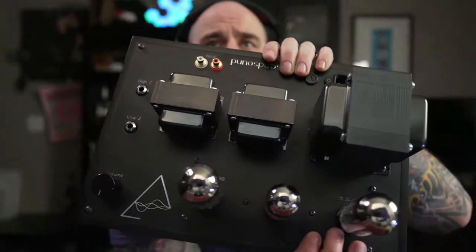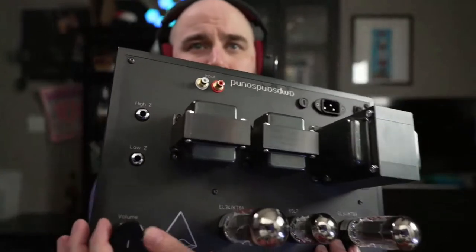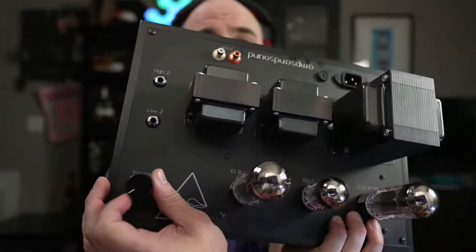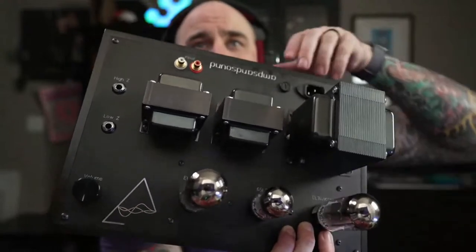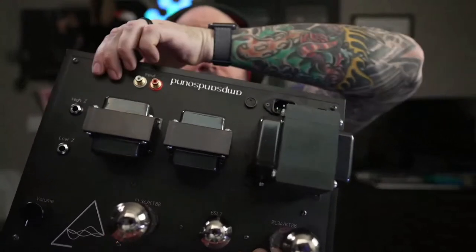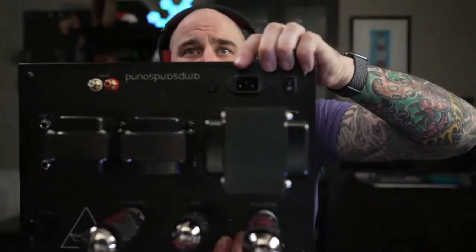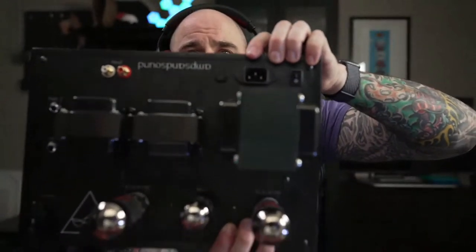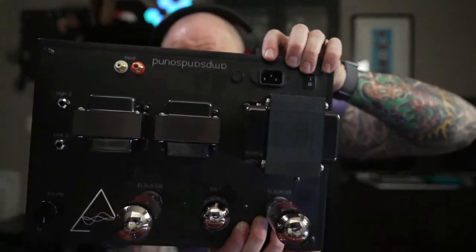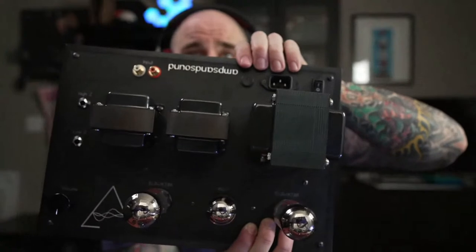I envision that anybody who uses this amp is going to invest in buying a decent power cord and is going to use good interconnects. One of the points is, if you notice, the RCAs are way in the back and really far away from the power switch, from the IEC jack. And the power switch is right next to the IEC jack so that there are no spurious points of introducing AC into the audio signal, right? But you've got enough room that you're going to be able to put a big Wattgate-based power cord there without any issue.